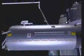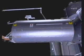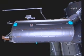The last task on the JPM is to install trunnion covers. The trunnions are metal posts that help attach the module in the payload bay. On orbit, they form a heat sink, so we install these covers to help prevent any concerns of condensation inside the vehicle.